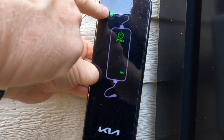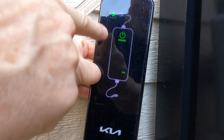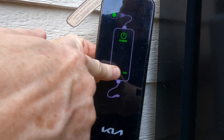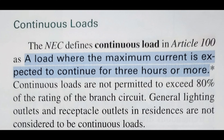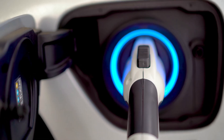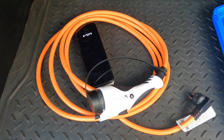I can see by the front display that everything is green. It's showing me power and showing me 12 amps — it has a setting that it will put out 12 amps. Why 12 amps? The National Electric Code says that when the maximum current is expected to continue for three hours or more, the circuit can only be loaded to 80 percent of its rating. Since EV charging can continue for three hours or more, we can only load a standard 15-amp circuit to 12 amps. As a result, most level one chargers only draw 12 amps.